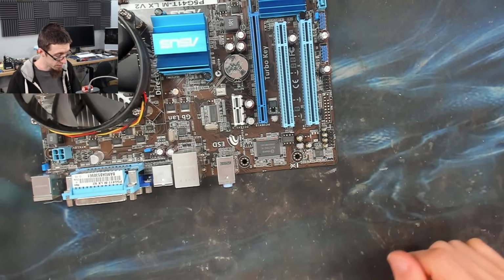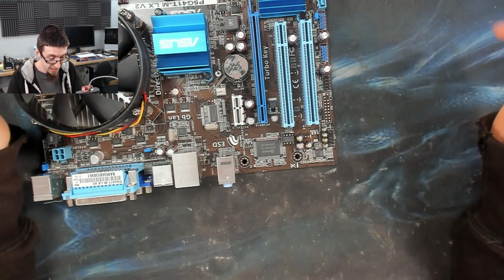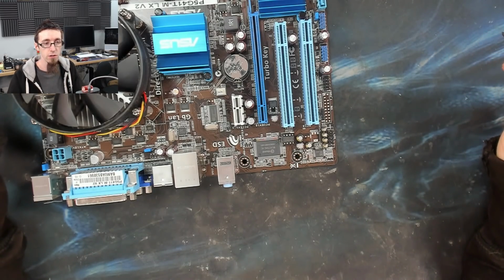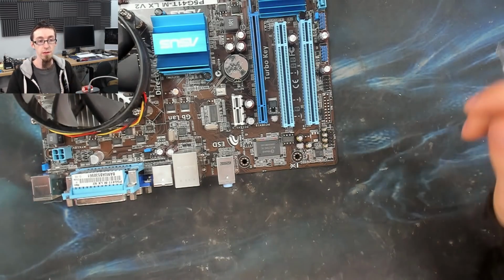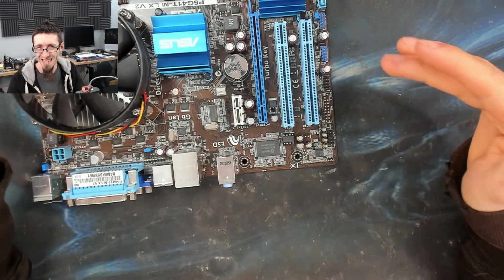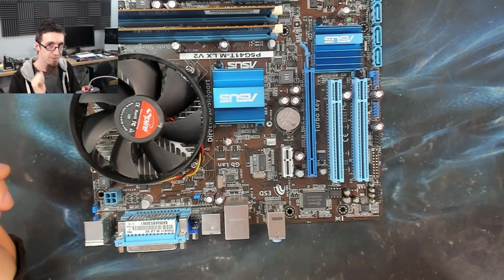These other black ones around the audio circuit here, and these guys with the golden stripe, those are low ESR capacitors for the audio circuit. I'm going to leave those alone as well, because they're audio capacitors. They're not doing big power capacitor jobs. They're fine. They're also nothing to do with whether the board works or not. So I'm not going to bother replacing those because I'll have to get a different kind of capacitor for there, and it's a hassle I don't need. Whereas all of these brown ones, I can more or less use the same series. I've just got to get the correct value for it.